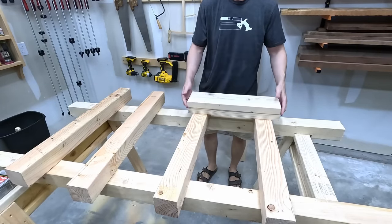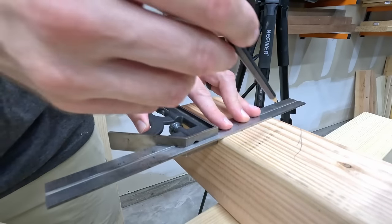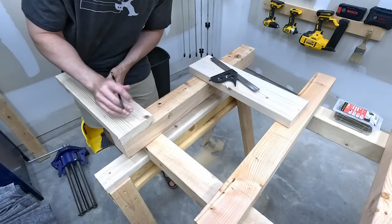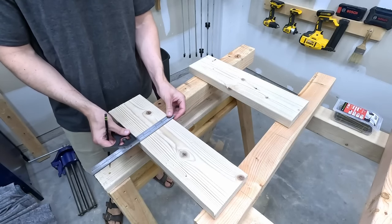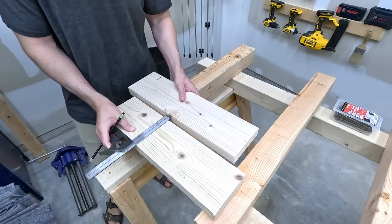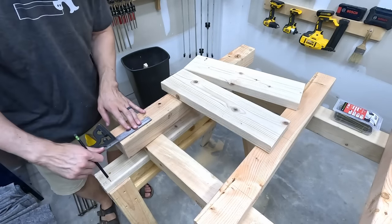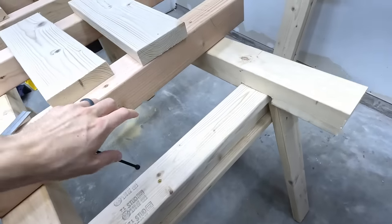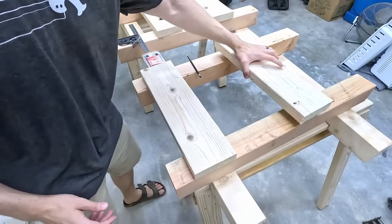The basics of this bench frame are made with two trestles where I join the 4x4s with some 2x6s, using a little line to help with positioning and alignment. But the roundovers on construction lumber make it hard to position right where I want it for that top trestle. So to get that just right, I stick the square out a little past the wood then bring it into place using another block of wood, getting a nice position line where the meat of that 2x6 is flush with the top of the leg. Remember to keep that outside corner when positioning these.